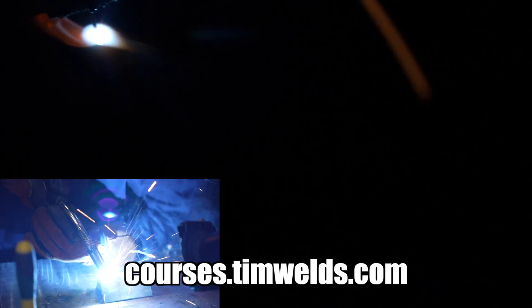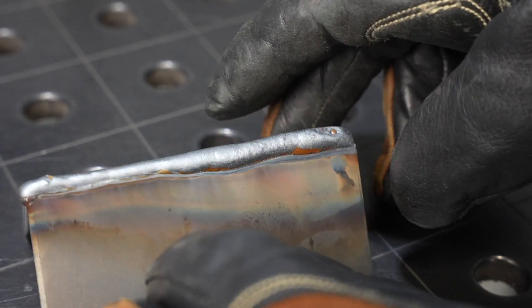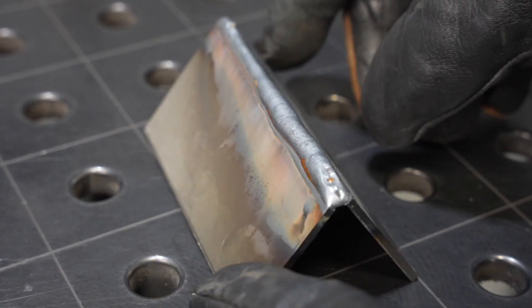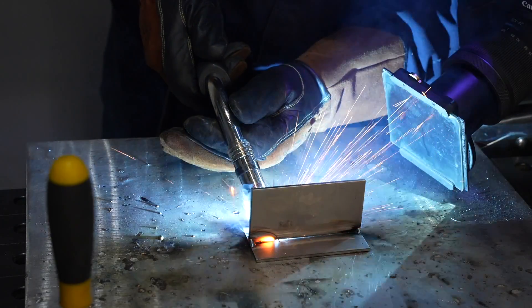Let me show you on an outside corner joint. This is a joint where you have to travel pretty quickly, so I'm going to travel at an appropriate speed at the beginning of the weld and then slow down at the end. As I've slowed down, notice how huge that weld pool is getting — that's my hint that I'm going too slowly and it's building up a lot more than I'd like. On the first half it rounds over really nicely — you probably don't even have to touch that with a grinder. But over here it's built up way too high, and that's all a result of travel speed. If you see a huge weld puddle as you're welding, you need to speed up.